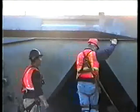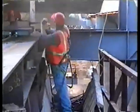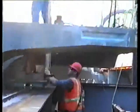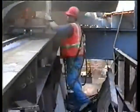They're only temporary. You can see the C bracket right there, that gray iron. It's disconnected from the cart behind Larry there because the truss has been launched, and now we just lowered the truss down on the column bearings below. So that C bracket is only used when it's riding on that cart and holding up the end of the truss to launch it.